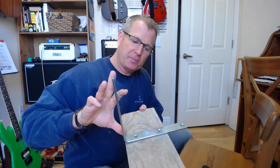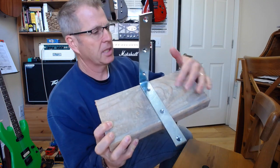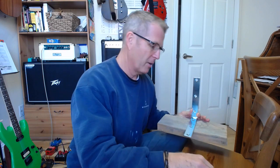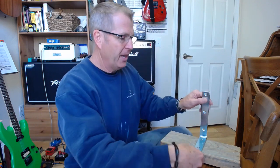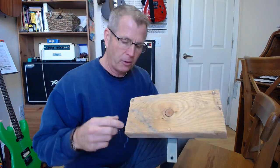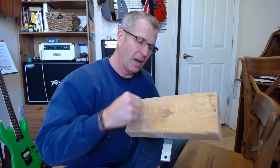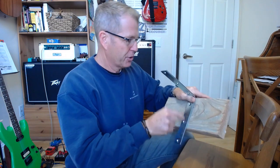Don't laugh — this is really cheap and efficient but it works. You'll need an eight-inch bracket, probably even a ten-inch, and two sheetrock grabber screws. You'll need a piece of two-by-six — that right there is an old piece of formboard with concrete on it. It's just a shelf bracket from a hardware store, another eight to ten dollars depending on where you live. You also need three little rubber feet. Why three and not four? Because if it's not level with four, you'll still get a rock. Three points of contact ensures a good base — two in the back and one up front.